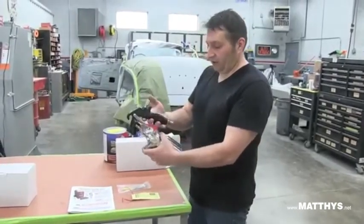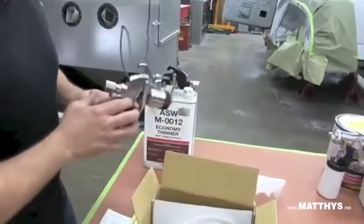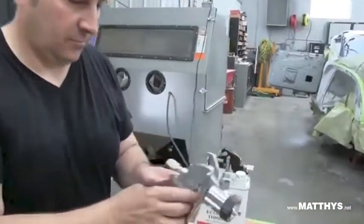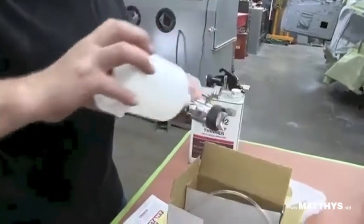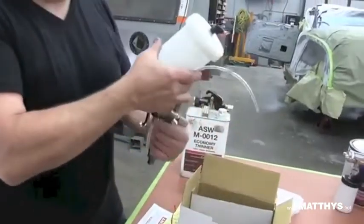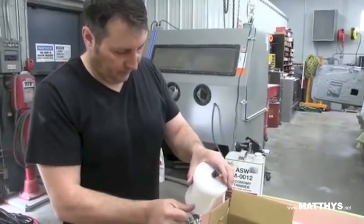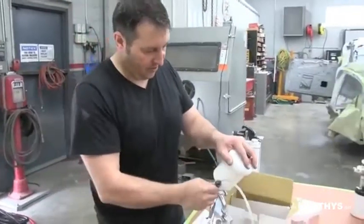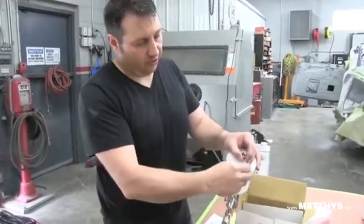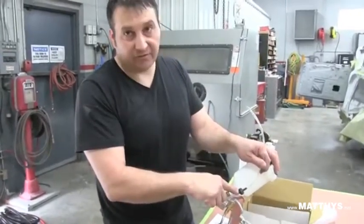Other than that it's very conventional — your fitting just fits right into the valve. The nice thing about the gravity feed gun is that they're pressure pots — it's pressurized. You have a check valve; this actually only goes on one way, wide end down, and then you just pull this. When you go to do cleanup, always take the hose out and clean the hose. Make sure you don't get lacquer thinner down inside the check valve, because it will ruin it.